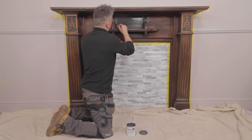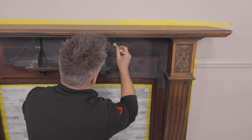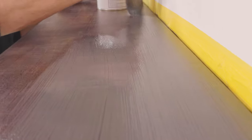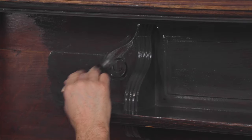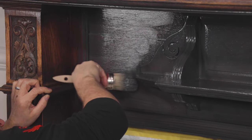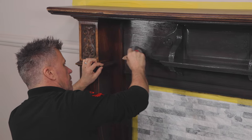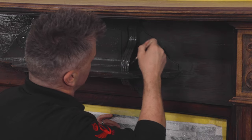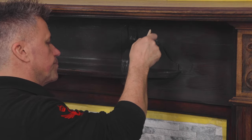You can also use Alfresco to give you a matte finish or chalk wall paint for an ultra matte finish. Painting a fire surround is pretty much the same as painting a piece of furniture although there are a couple of important things to remember. If your fire itself produces a lot of heat which causes the surround to heat up, then you will need a paint that has sufficient heat resistance. As a general rule of thumb, don't paint a surface that is likely to become too hot to touch. Do not paint any areas that could come into contact with flames — this will cause discolouring and possibly peeling.